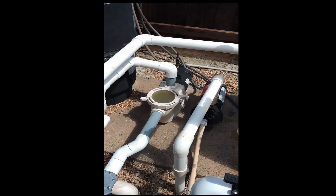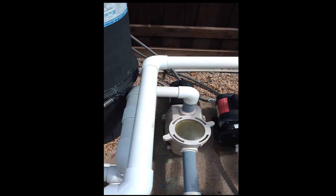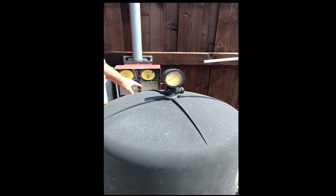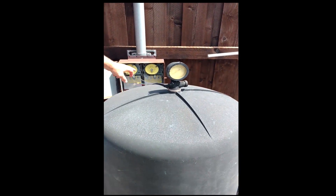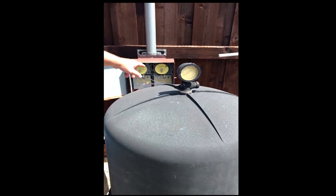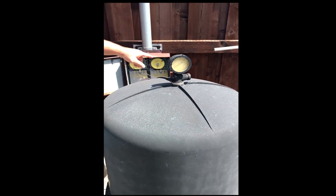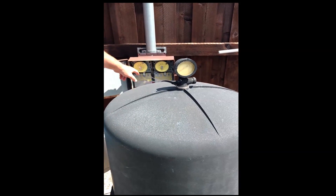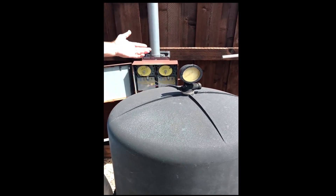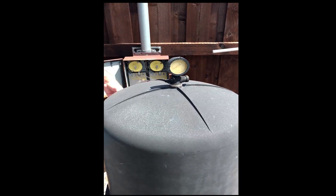This is the pool sweep pump, and on the left is the main pump. A lot of setups wire it so the sweep won't turn on unless the pool pump is on — I don't have it wired that way. I like to just manage when my pool sweep's on; it's not something you need to run every day. If you hook those up, it's mechanical — you've got an on tab and an off tab — and it's just going to run every day, which you don't need. So I make it separate; it's a manual thing. I come out, turn it on, and turn it off.